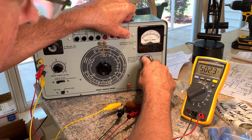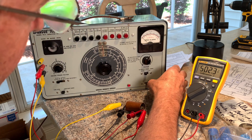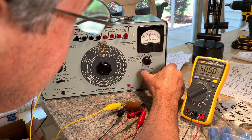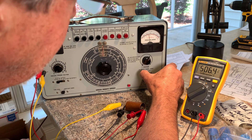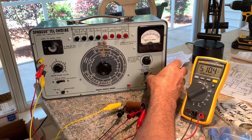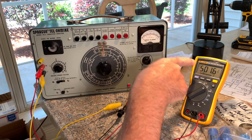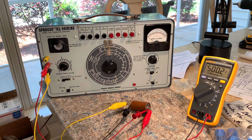I'm going to turn it down a little bit. It's working its way up. See — on this scale it's dropping, it's below 3 milliamps now, going about 2.5. Like I said, the max is 1.1 milliamps. So we're still over the max. I'll lower the voltage — I'm at 510. That's what's nice about having your meter hooked up to it. We'll let this thing sit for 5 to 10 minutes and then I'll come back.